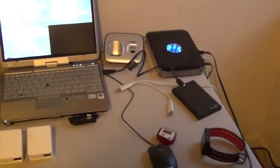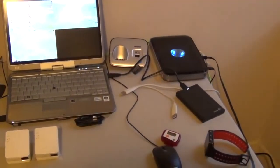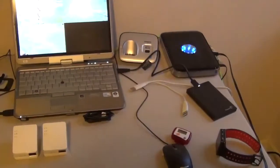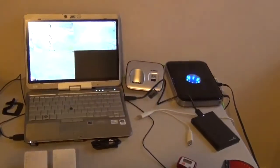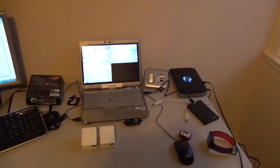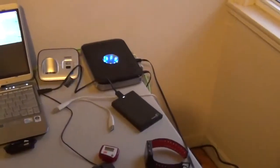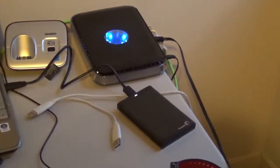And to set up an access point, I can get into that in another video, but for now I'm just going to go over how the cameras are communicating with the router and how I set up the server, and how it sends me email alerts when it detects motion, and how it records. I have a 1 terabyte hard drive that'll back up video on 3 cameras for up to 2 weeks straight, 24 hours a day.